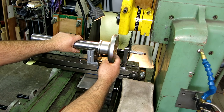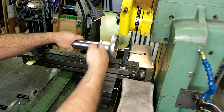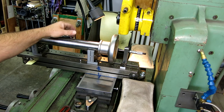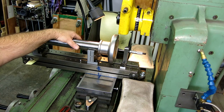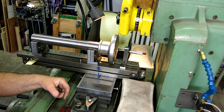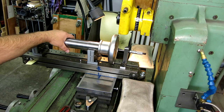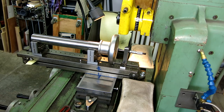I'm gonna sweep one of these pads. So I'll sweep it on this side, then I'll rotate it over, and I'll sweep it on the other side off of the spindle of the grinder. And hopefully I can get it reasonably square that way and not ruin what we measured over there a little while ago, which wasn't bad. So anyway, that's the theory. Let's see if we can make it happen. So let me get set up with the indicator, and then I'll bring you back, and we'll get this aligned a little bit and go from there.